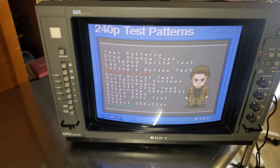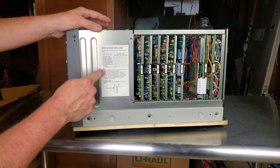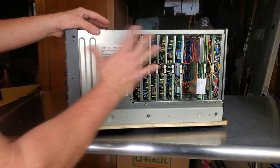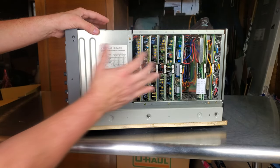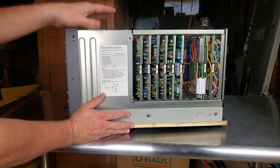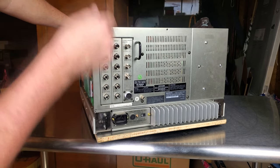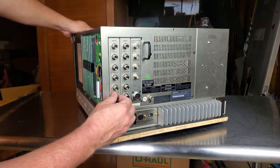Right now it's behaving for the camera. Over here on this side are all our input cards, and it's a configuration thing. There's a key to how this configuration works — which compartment you need to have the card in and which card you need in each compartment. There's obviously a different configuration you could have on your monitor, so just check to make sure you have the right cards and something's not missing, because a missing card could be the whole issue. The cards I'll be moving today are these two, and then we'll remove this back plate to get into our input area and inspect that.